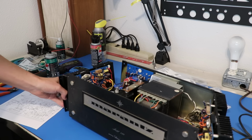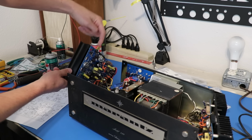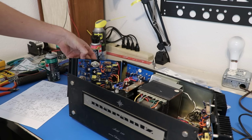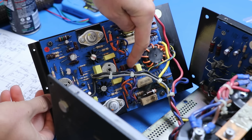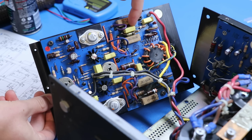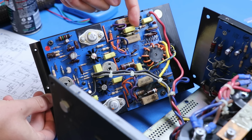And you've got a similar situation on the power amp boards. Like this one right here, this is literally just a dropping resistor. All it takes is rail voltage and it just drops it down to another voltage and it gets quite hot. You can see there's some other carbon comps in here, like you've got this one right here. And then underneath this mess is another carbon comp. It's a 39 ohm, I believe. And I'm looking at it closely and the case is actually cracked, so that's kind of interesting.